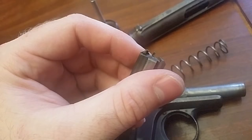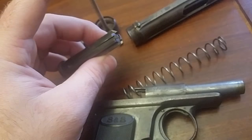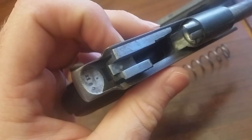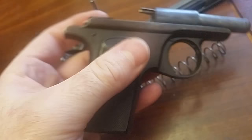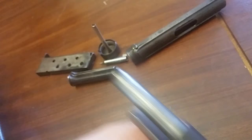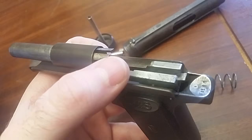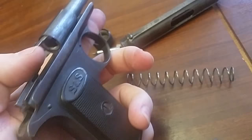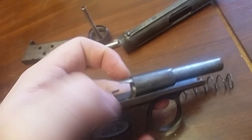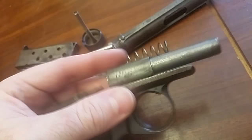It's a mostly supported breech face. I think the top is to aid in feeding or to prevent the round from kicking up and stove-piping. The magazines probably aren't the most reliable, but the design allows for that — a round can stove-pipe up into it, and between the angled piece on top that catches it and drives it and the upper feed ramp, for lack of a better word, you have a pretty reliable system.